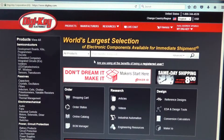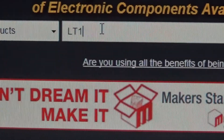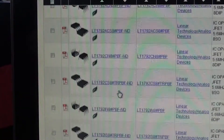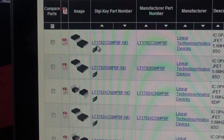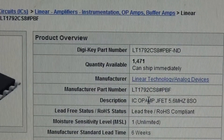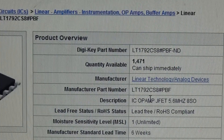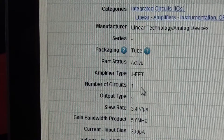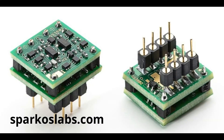To find out if it's a single or a dual, go to digikey.com and type the part number — in this case LT1792 — into the search bar. You might get several results, some of which are package variations, but the main number is what they'll all be listed under. Click on one, and first make sure it is in fact an op amp — not everything in an eight-pin package is. Then look under 'number of circuits': if it says one, it's a single; if it says two, it's a dual. Single op amps can be replaced with our SS3601 discrete op amp, and for duals you use the SS3602 dual discrete op amp.